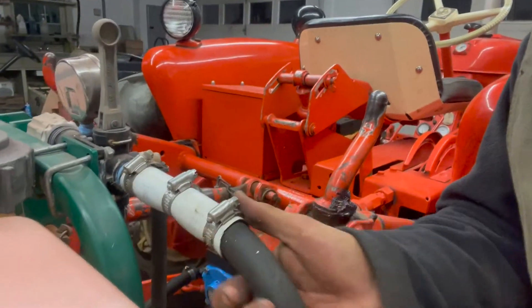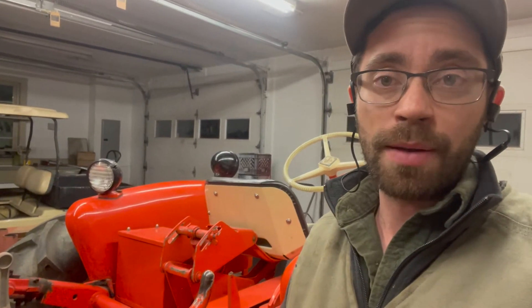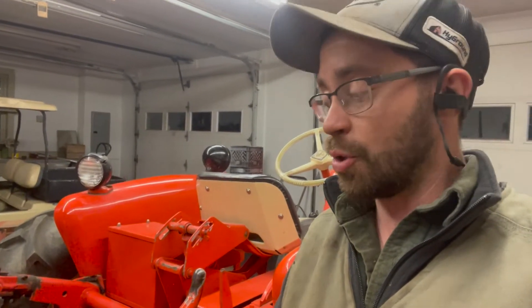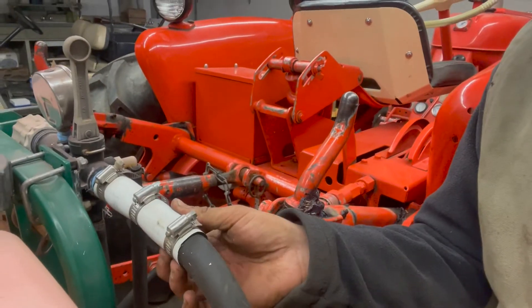But I did something here which I've never done before, and we're going to try it. This is like an inch and a quarter, inch and a half hosing for sprayers or high-pressure units. The hose towards the end where it goes into the manifold is pretty weak, and it's been drooping down, actually causing lost pressure in the line because it's kind of collapsing on itself. So what I did is I took a piece of thin-walled one-inch pipe.